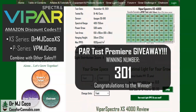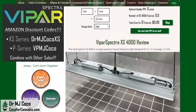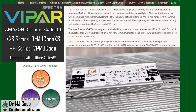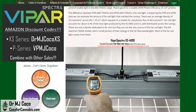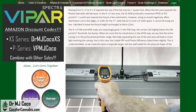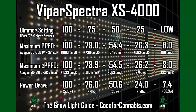If you missed the premiere, subscribe to my channel to be part of the next one. Below the test data you'll find my written review. The ViparSpectra XS series are nice lights — they use top-end components, are very easy to use, and the spectrum they produce is excellent. The XS 4000 can cover 5x3 or 4x4 spaces with great densities of light. After testing, the heat sink hit a maximum temperature of 58.6°C (137.5°F), and the drivers ran warmer at a maximum of 62.8°C (145°F) — reasonable temperatures for a 500-watt quantum board. The dimming knob is continuously adjustable with markings at 25, 50, and 75%, and the PAR and ePAR wavelengths dim in unison.